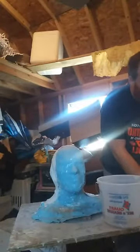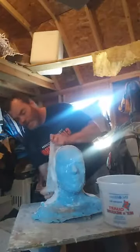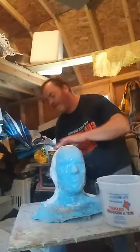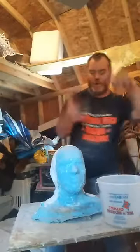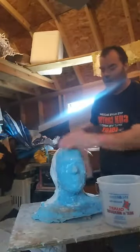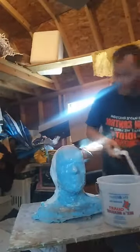If you don't want to double it up, you can put single layers on there, but if you double up, it will be a stronger reinforcement for what you're doing. Since these are hand rotocasted, we'll have to pick it up and turn it, so it is better to have a good support shell, so the texture and features in your mold don't get soggy and soft.